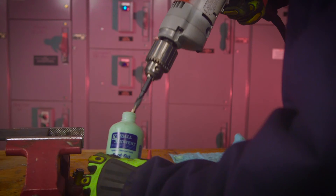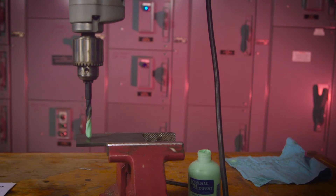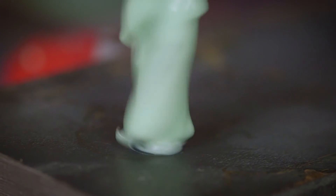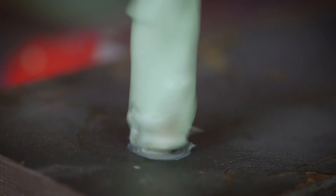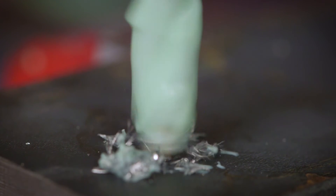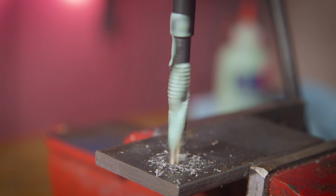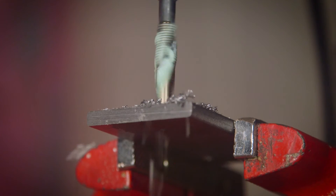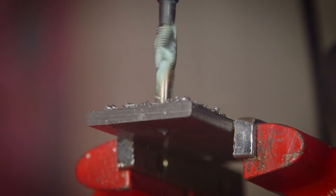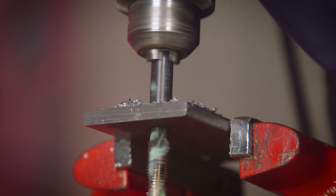The Cryogen Power Tap is designed to drill and tap in one continuous motion. When you start the hole, the drill bit has a 118 degree split point — no need for a center punch. The tapered lead threads make the transition from drilling to tapping easy. It's also quick, drilling and tapping the hole in a fraction of the time.